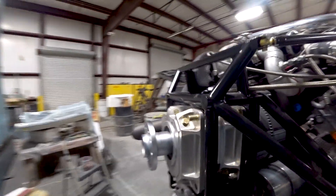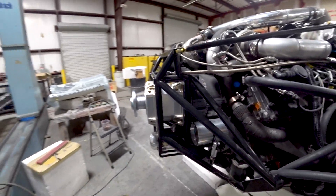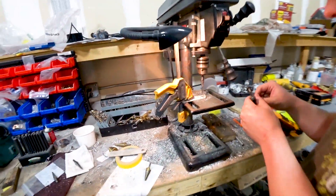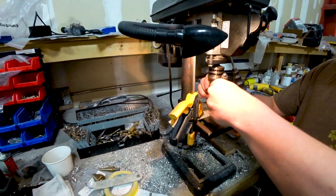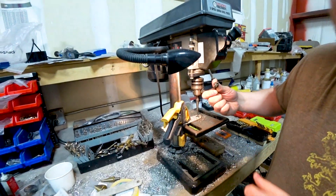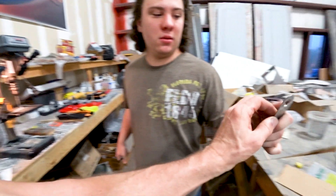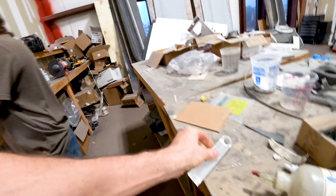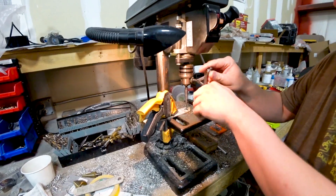Back on the engine, I've got Devin removing the redrive — taking off the bolts to pull it off and replace the oil rings. We also couldn't use the straight fences that were going to double as tie-downs because there wasn't enough gap between the strake and the wing itself. Instead, we're just creating a couple of small hooks from 4130 steel that will protrude down from the wing intersection.